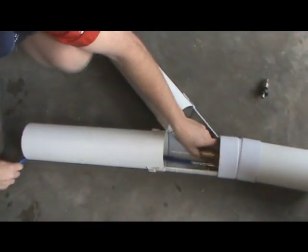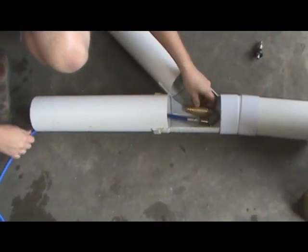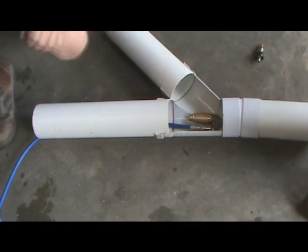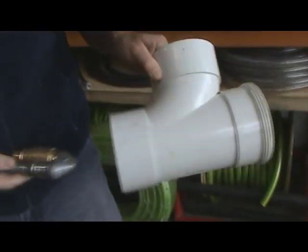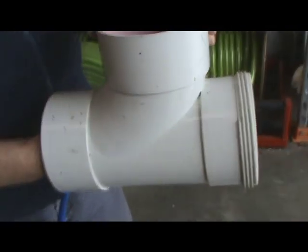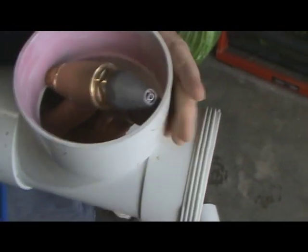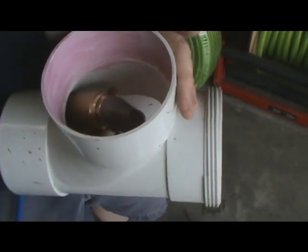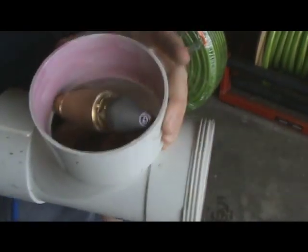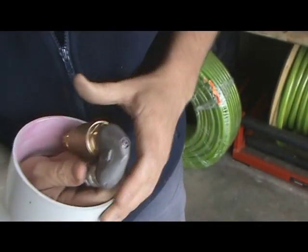So when it's running, it pushes on a big angle like that - it could be on any angle of the pipe. The other problem you get is square inspection openings in a drain. It could be going along and get stuck up. If this is capped off, it'll sit there, it'll wedge itself like that, and it won't come out. Normally the little inserts are sitting in here. If there's no insert and it's not raised up, it'll just sit like that, get jammed, and you won't get it out unless you've got an extension on your jetter.